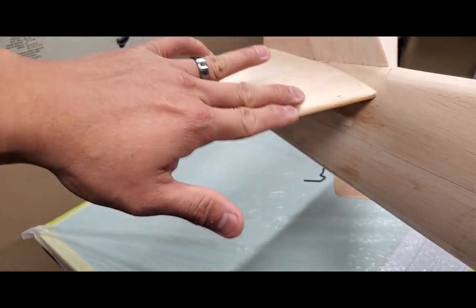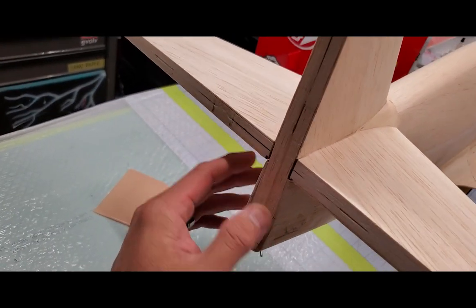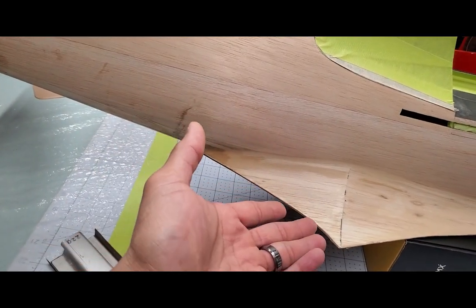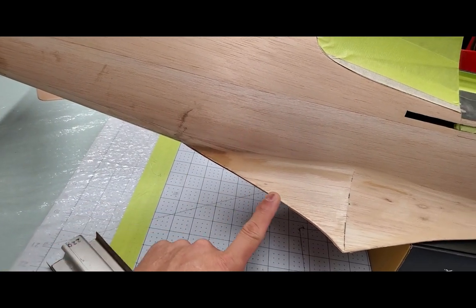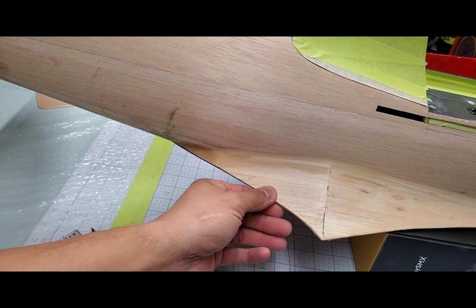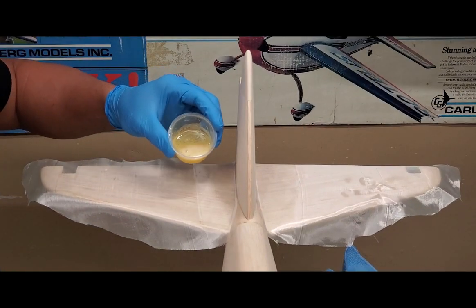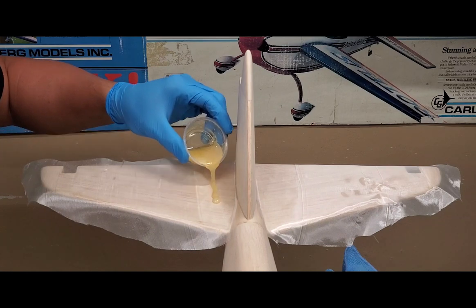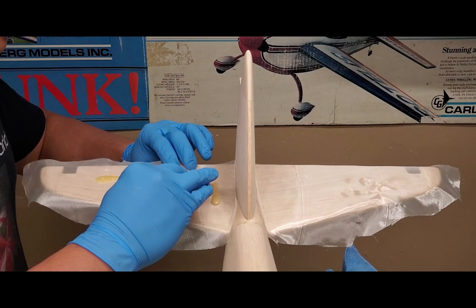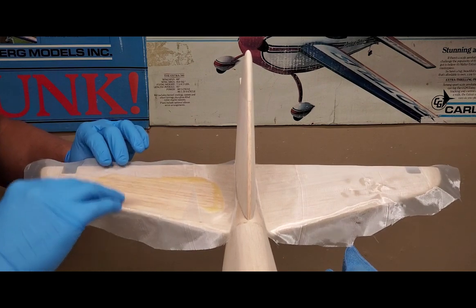It's just the resin and glass, just blending it in, and I did that all the way around, and also to the other side. I did that with the bottom section here with all that glass that was sticking out from the bottom. After we trimmed that, I went ahead and sanded all that smooth, so the next layer of glass, when it comes down, we can have a nice seamless joint. Holding down the glass so it doesn't move, just in the meantime.